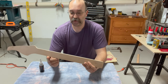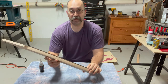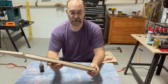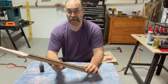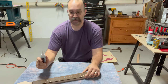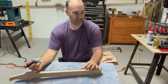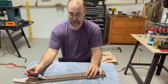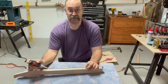After running this on the belt sander with the 220 grit belt, it started to smooth out the edges. The goal isn't to completely avoid filing down the frets — it's really just to smooth them out a bit so we can do less hand work. The last step I'm going to do is take some black CA glue — the same glue I used for the fret markers — and wick it underneath the frets. There's some question whether you actually need to glue your frets down, but I'll wick the glue into the slots and let it dry for a while.